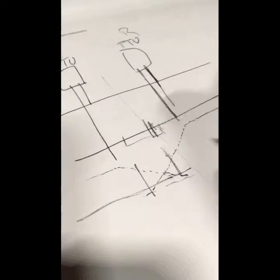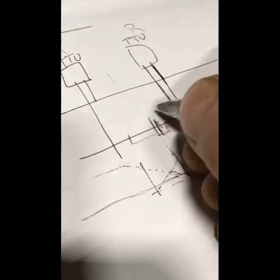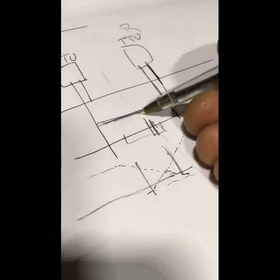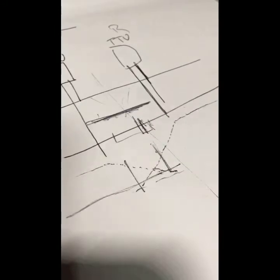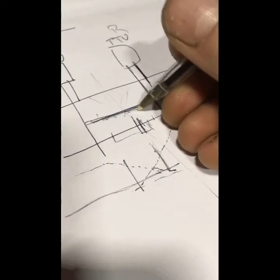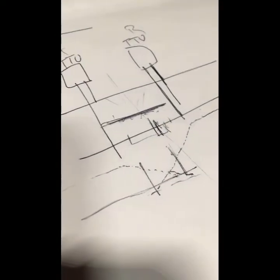And one thing to be really aware of is P-Way like to leave rails and things here, and if you leave rails there, that affects the tuned zone, because obviously metal inducts, so it can cause several problems there. So you've got to be careful it doesn't induct and drag the tuned zone even further.